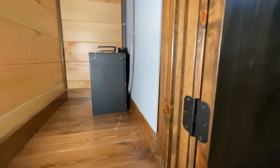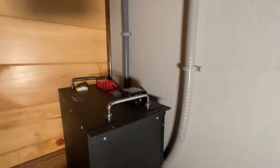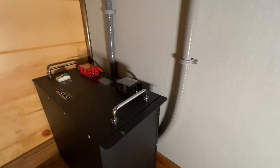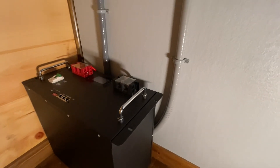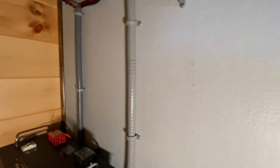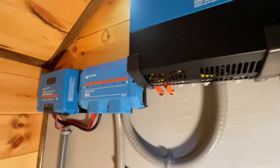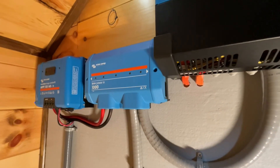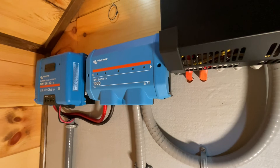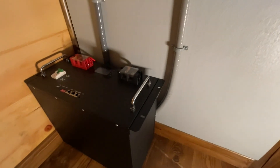System is converted to heated lithium iron phosphate batteries in the form of a server rack battery. System voltage is now 48 volts nominal, which gives much more efficiency on the inverter side. Standby consumption of this inverter is only 11 watts — 2 watts less than the 12-volt version. I'm also very happy that the inverter doesn't buzz under load as much, and overall I'm really happy with the conversion. That's all I have for you today — see you guys on the next one.